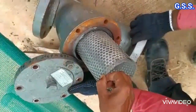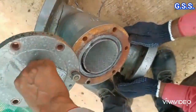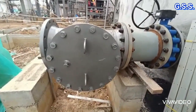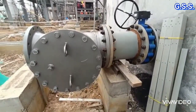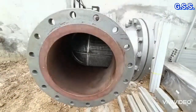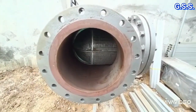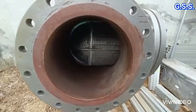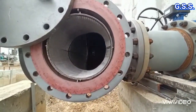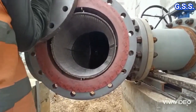This Y strainer is correct and not having any problem. This is one T-type strainer. Inside the flanged T, a filter element is there. You can see the filter element from the T strainer outlet side. This is the view from the branch side, from where the filter element can be removed in the horizontal plane.